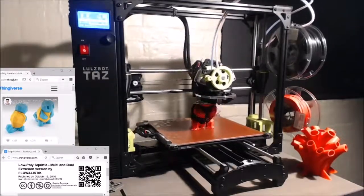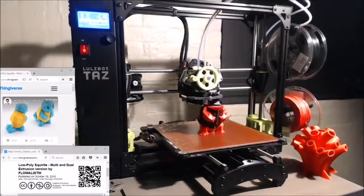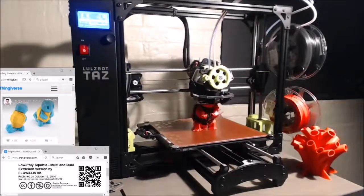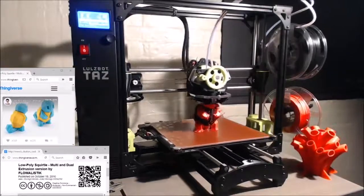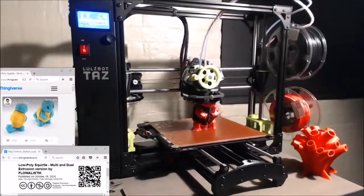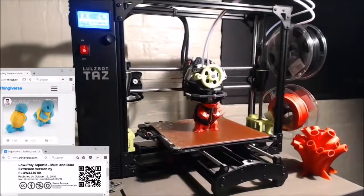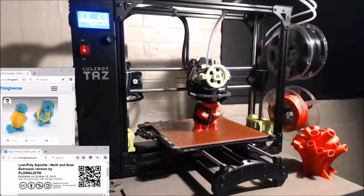Another thing you can do is make sure it moves a little bit between layers as it's switching. That's the most critical part, because during the layer switches it actually switches often from one extruder to the other — pulling the filament out of one and descending it into the other. If you just leave it at the place where it stopped, it creates those big craters like I was talking about before.